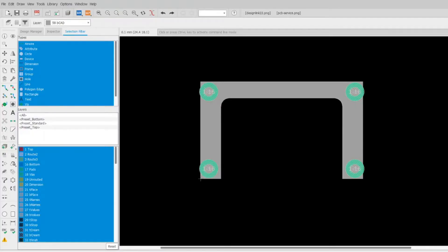So this is a software package called Eagle. I've isolated the area that I want to chop out and the four holes that I want to drill. I'm just going to be spotting the hole centres with the V-bit and doing an isolation route to denote the outline that I need to mill to.